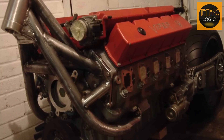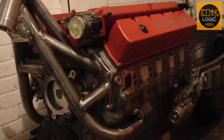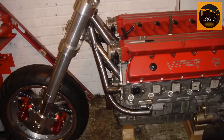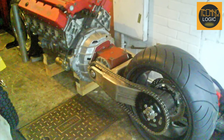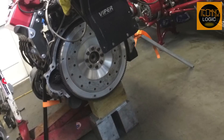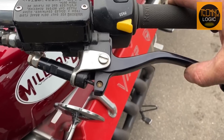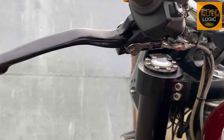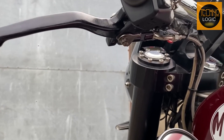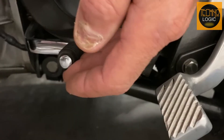For the frame, Alan Millard chose a tubular steel design and had to remove some unnecessary engine components to fit the front subframe. Essentially, this motorcycle only uses a front subframe and a rear swingarm to support the Dodge Viper V10 engine. The transmission uses a single-speed with a manual clutch. Since it is single-speed, there is no neutral gear, so he had to constantly press the clutch to stay in neutral. Because the hand clutch was heavy, he needed additional foot-operated clutch assistance, requiring a mechanism to wedge behind the foot clutch to keep the engine in neutral.